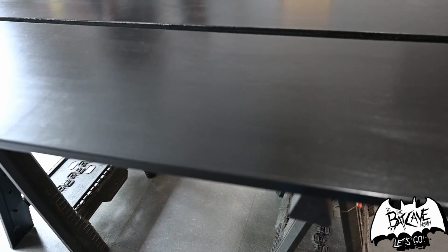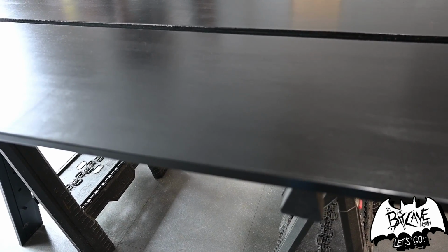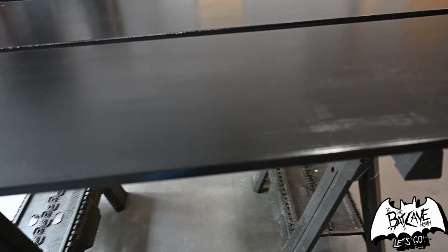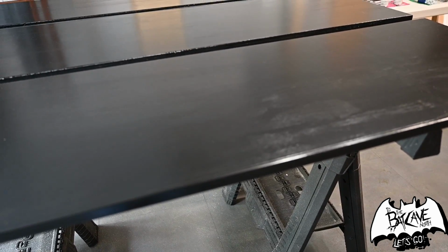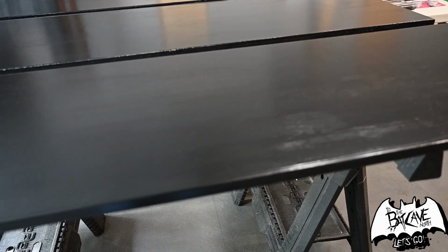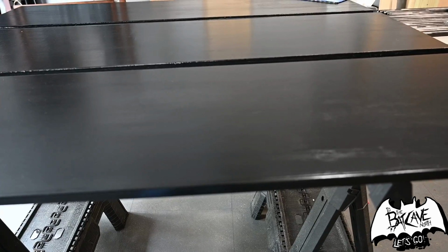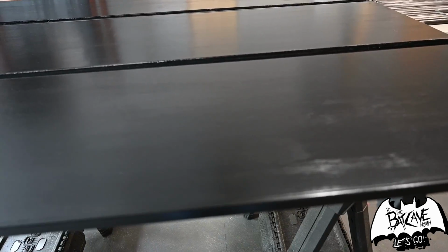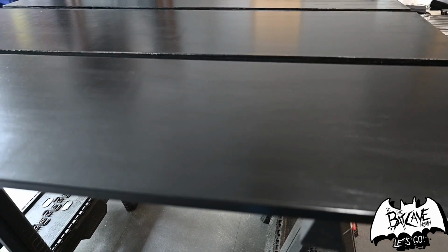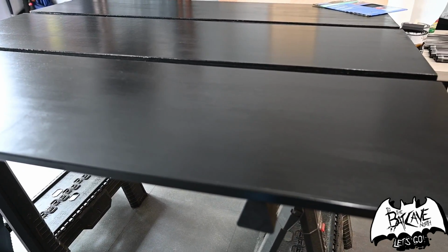One of the things I wanted to mention too was, because it's a plywood and I didn't want to see the striations in the wood on the front side of what will be the shelves, I included a finish strip. It's just a simple 3/4 inch clean piece of pine. It comes in a molding already done. I literally just tacked it onto the front with some super glue and some very small finish nails, and it makes a nice clean edge for the front.